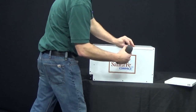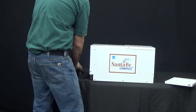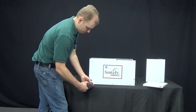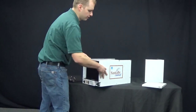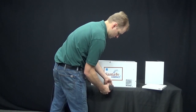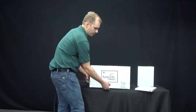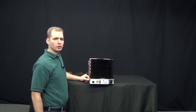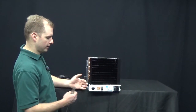Remove the back cabinet first by pulling it up and off, then set it aside and work on the bottom screws, plus another three on the back. To remove the front cabinet, pull the bottom out on both sides, flex it open slightly, then pull it up and off. The next step in removing the humidity control is to remove a couple of screws in the front that mount the humidity control, remove the knob, and pull it out from the side.